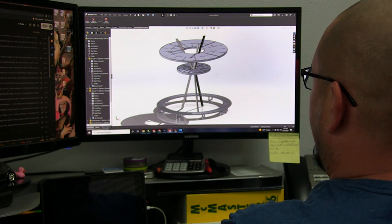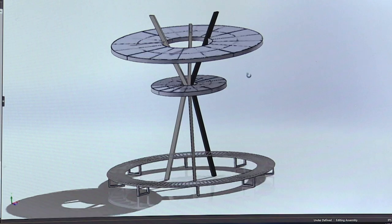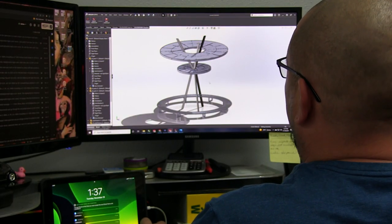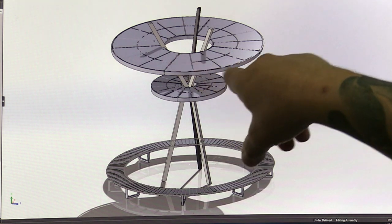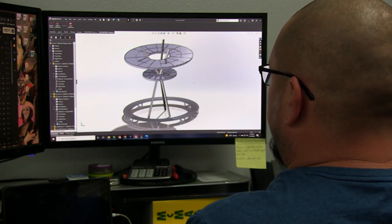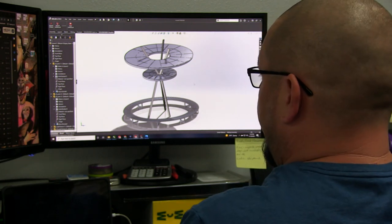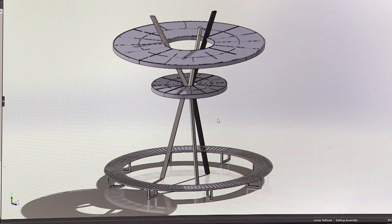When we first saw this project, a lot of people thought it looked like something out of the World's Fair or the Space Needle or even Men in Black. I think this is what the Mayans actually based their calendar on, to be completely honest with you. It's going to come down to a lot of really meticulous fabrication by Rob. When I went to engineering, they came back and said it needs to be engineered to support the weight of a person, should somebody ever climb up onto it. The biggest concern was all the angles going into these circles and how we were going to make this attach and actually be structural. The original plans called for a six-inch by one-inch hollow tube that we could bend, but throughout the process they ended up wanting this to be load bearing, so we had to change it to solid aluminum that's one inch thick. Now we're dealing with an extra four thousand pounds of weight that we've got to try and support.